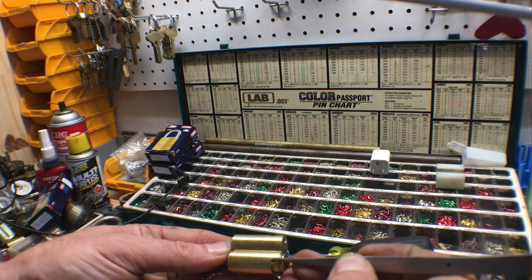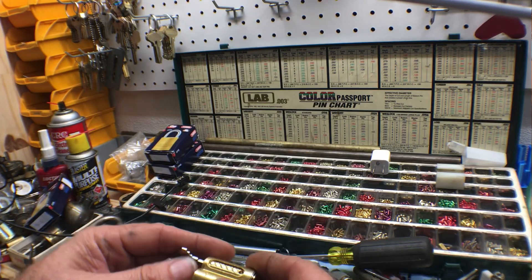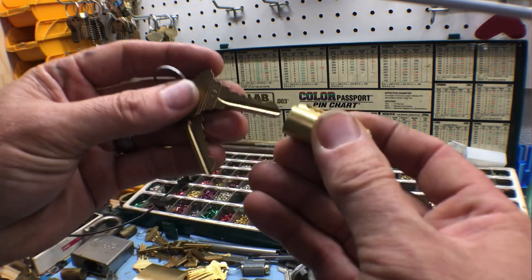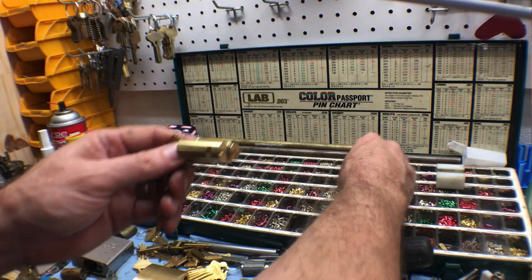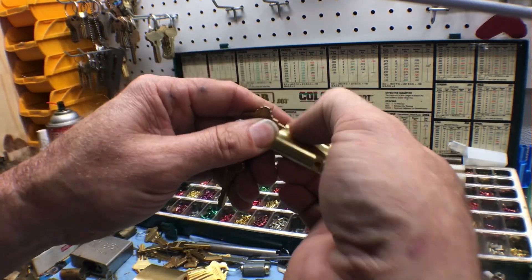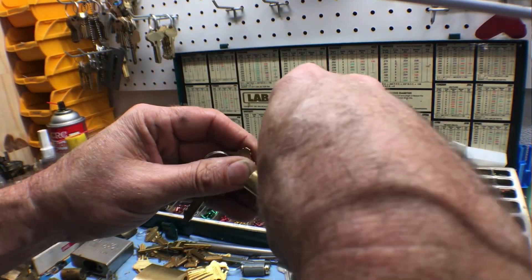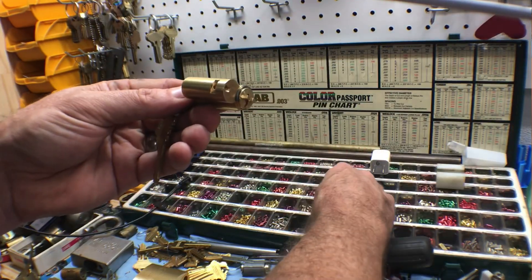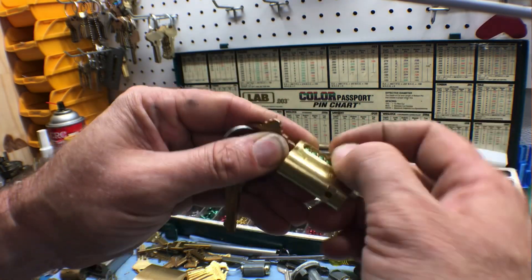When following it out, you'd normally turn it to this position and follow it out, but that spring-loaded thing can get caught up in the chamber right there, so you definitely don't want that to happen. Just to point this out - we're going to key this up as standard. Most of you know with your keys, the bitting on it tells you what pins to use - so three, five, six, seven, three. We'll go ahead and key it up: three, five is a 240. Three, five, six, seven, and three.